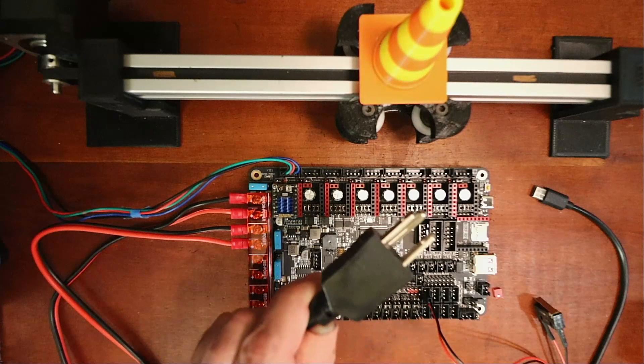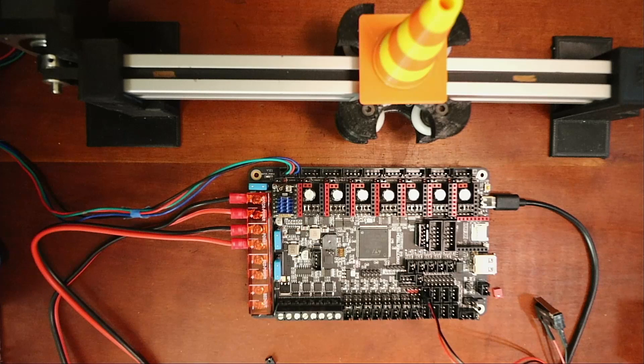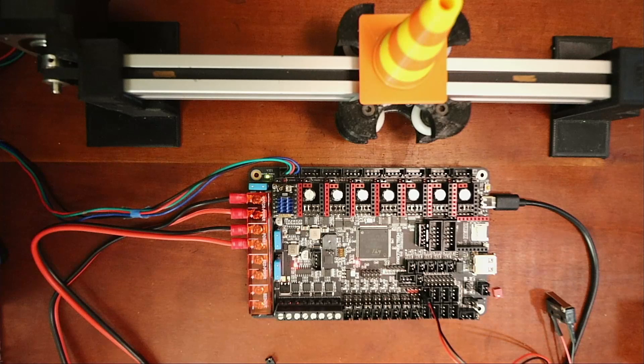On the actual board I'm going to plug this in since it's currently disconnected, and connect the USB as well for connectivity when power comes up. It's powered up. We're going to use this clickable endstop to toggle the endstop when it gets to the end - you might have to double-tap because that's how it's designed in the software. Let's go over to Pronterface.